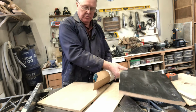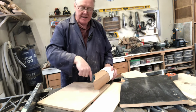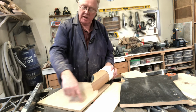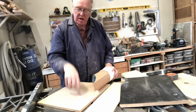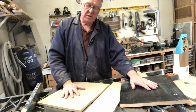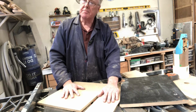And that will, then we'll have a large hole in the bottom of this piece that the top of the cone will fit into. And that little green mat is going to be used to create kind of the circle in the hat to guide all the wood chips and dust down into the cone. So I'm going to mark out the hole for the top of the cone, and then I'll mark out the hole for the pipe that's going to be used to feed into the blower unit. Then we'll cut these sides to length and think about assembling it.